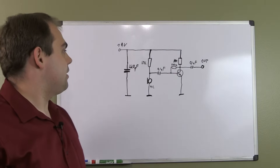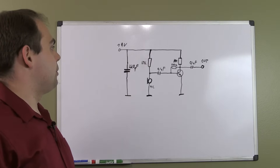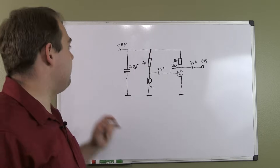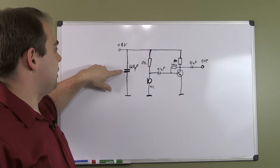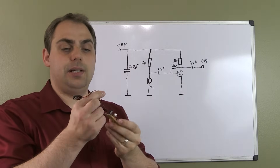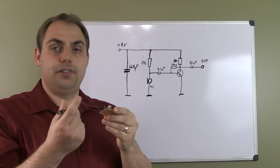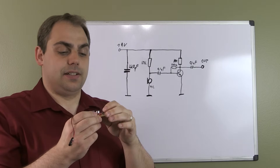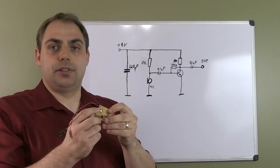The circuit is drawn behind me here. I did everything for nine volts, but this circuit works in a pretty large voltage range, all the way from five volts at least up to 12 volts with no problem. The first thing I did was put a humongous 220 microfarad capacitor in here just to stabilize the voltage a little bit, especially if you have nine volt batteries with cheap leads that have quite a bit of resistance and inductance. If you have any variation in the voltage draw, like in this amplifier where current draw goes up as amplitude goes up, you really want to make sure you get a stable voltage supply.